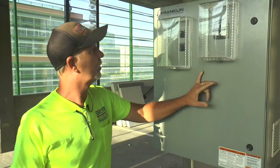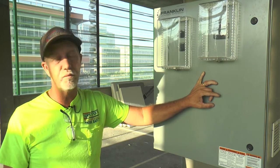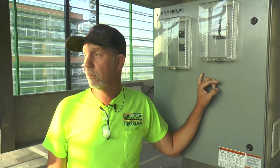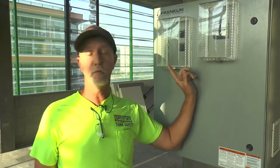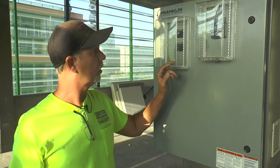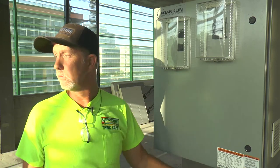The second set of switches are known as auto, hand, and bypass. If the system fails on the fire side and you want to do a manual test — one that won't actually call the fire trucks — you can physically turn this into hand and put it into bypass, and it will run the motor at 100% for the fan. Currently the system is set up with the fire panel to be in auto mode only, so the fire controls have full control.